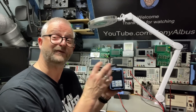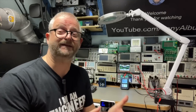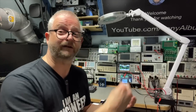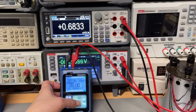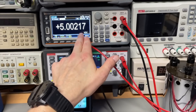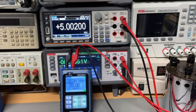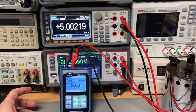When we have a closer look at the voltage that comes out of these other devices, what you are about to see is maybe a little bit disturbing, but in the end it is actually not — because these devices were not designed for what we are doing. We are doing tests way above their specifications, so it doesn't mean the device is bad, it just means we are testing above specification. Let's start with this process calibrator. When I switch the output on we can see a reading at about 5 volts — this could maybe be calibrated a bit better. But the main point is if we look at the numbers, it goes up and it goes down. So if you want to verify your multimeter with this, you are not really sure if your multimeter is unstable or if it is the process calibrator.